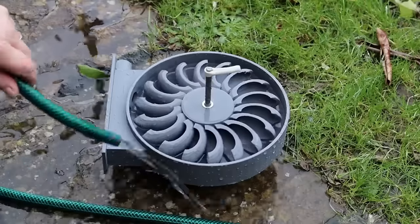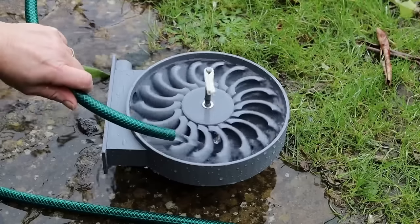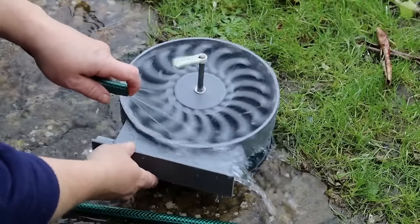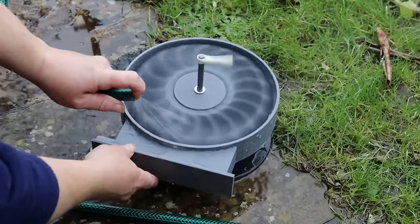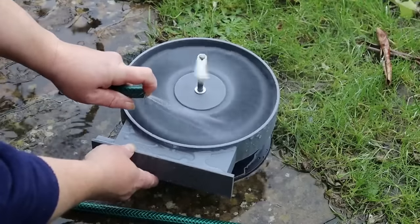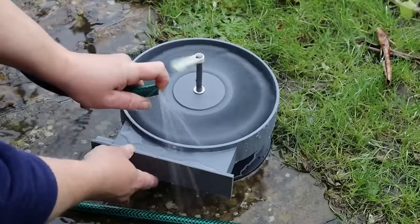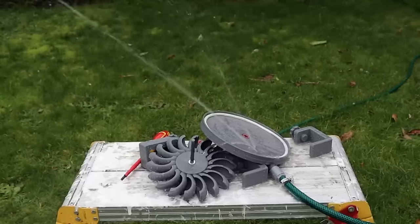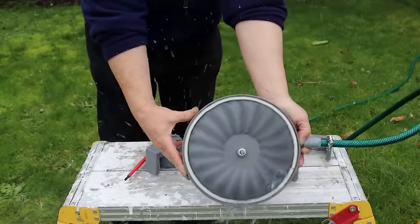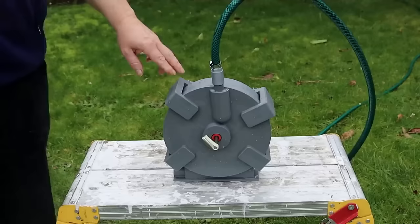Any water wheel is going to work if you point some water at it, so we point the hose without the top on and of course it's going to spin. But this is the difference it makes when we change to pressure - I put my finger over it and create a bit of pressure, the volume of water changes, the pressure goes up, and look how crazily it spins. That is the benefit of a thing like a Pelton wheel, or in this case a turgo turbine. The turbine operates best when the water jet is somewhere between 25 and 30 degrees - these holes in the lid are set at 30 degrees.